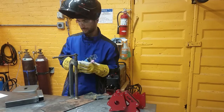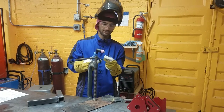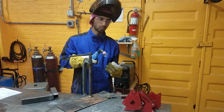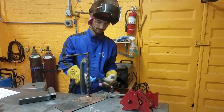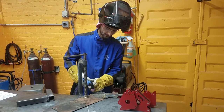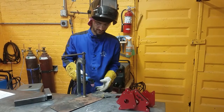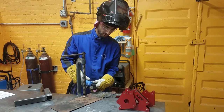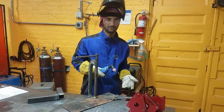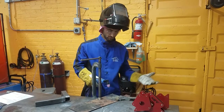Something else: there's a cone of plasma that comes out of the torch, and when it comes out, it spins counterclockwise. The best cut is going to be on the right side with respect to your direction of travel because of that — similar to why you only go one direction on a router. When cutting by hand, if this was a quarter or half inch thick, it would be important to make sure the part you're keeping was on the right side, because that would be the nicer side of the cut. As you're going, the goal is to have a 90-degree edge, and you're trying to manage your speed and settings to make sure that happens.